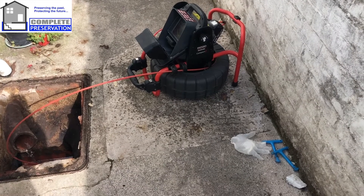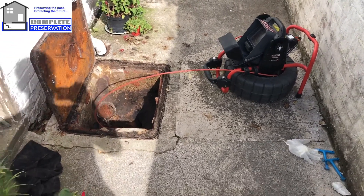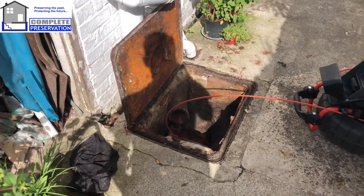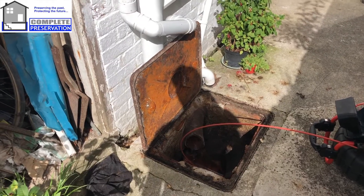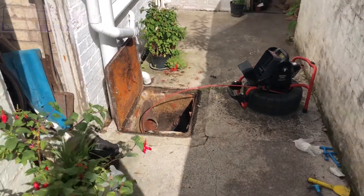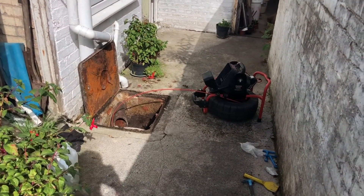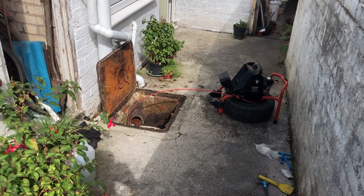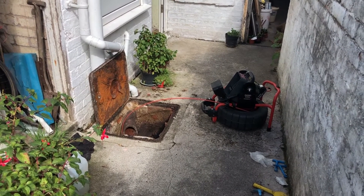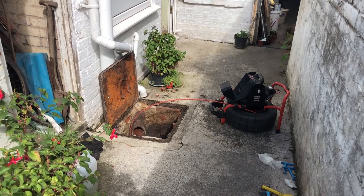The chap that lives here has lived here for a very long time and doesn't know anything about it. All these issues are a great cause of rising damp internally, and just doing some kind of damp-proofing system inside — whether it's modern or traditional — is probably not going to resolve it. If you've had long-term issues with the drains like that, it can wash out the ground around them and cause subsidence issues, so you've got to be very careful. We're going to get all this resolved. Thanks for watching.